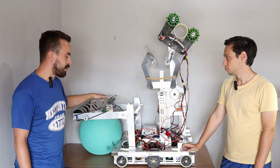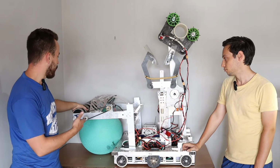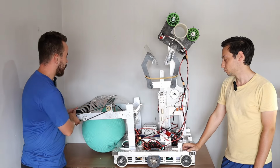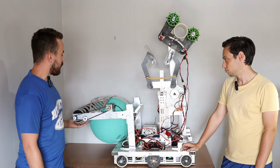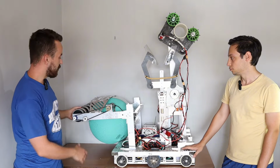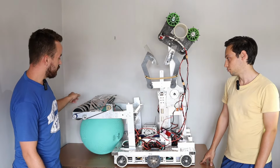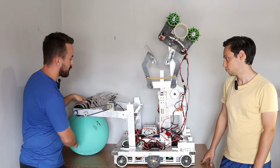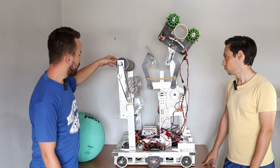As we mentioned in our previous streams and videos, we went with a simple intake mechanism that collects from the ground using a roller on top. This allows us to pick up balls easily. That's basically it. We don't collect through the inside of the robot due to space constraints, and also because we can use the same roller to launch the ball. This helps us stay within the frame perimeter. We just elevate the intake to fit it neatly inside the robot, keeping it centralized.